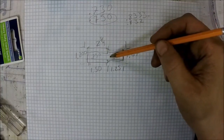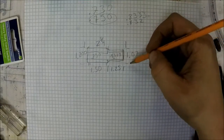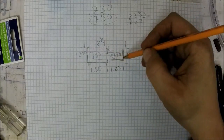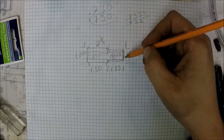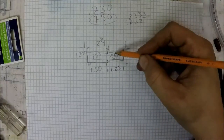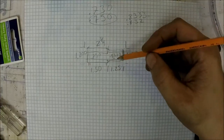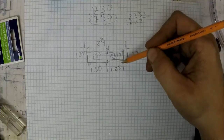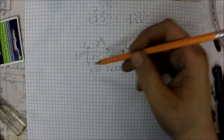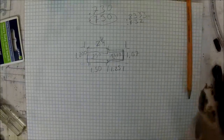And then we're gonna make a finishing cut, or what I call a skim cut. I'll come in here and zero everything out with it barely touching, and then make a pass so that I have a clean bore I can measure, and my machine's zeroed out so that I know that bore is 0 to my dial. And then when I start making my cuts, I know exactly where I'm at. I'm not second guessing and bouncing all over the place. I can come in, zero the machine, make a cut, measure, and then I know how much I have to go from there. So let's get back on the machine and we'll get it done.